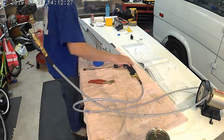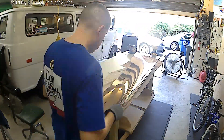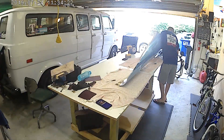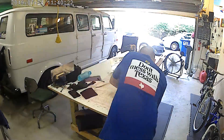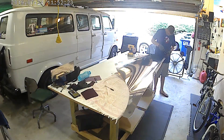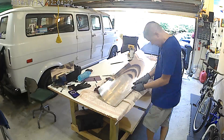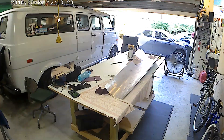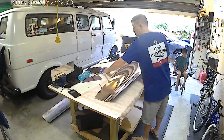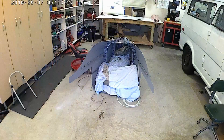After that they have you move on to the side skins. With that last little rib I found you really needed the 12-inch-long back riveter just to get past the web and the spar. There's a whole bunch of deburring and scuffing — I probably should have cut this out but I left it in. Easily 60–70% of the time is deburring, scuffing, and priming, and it just makes me feel better when I see it all done in 30 seconds.